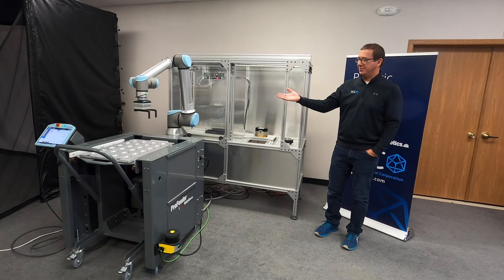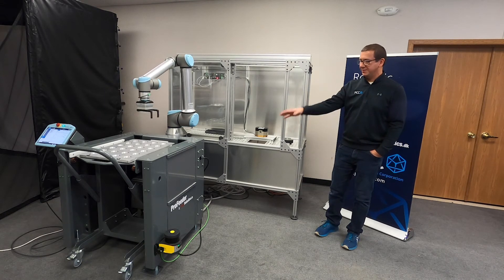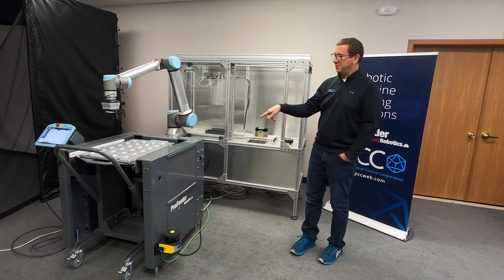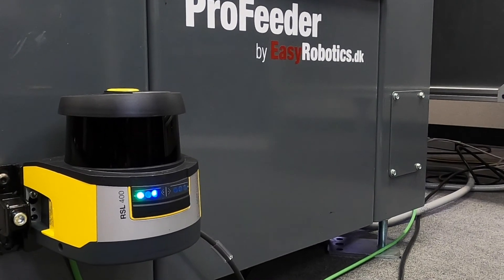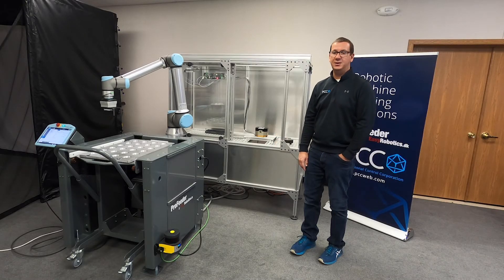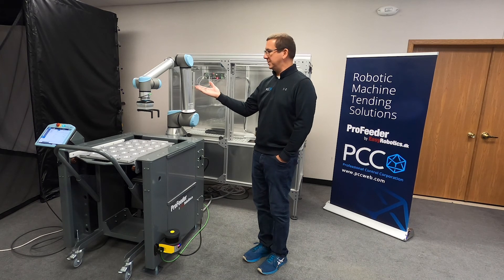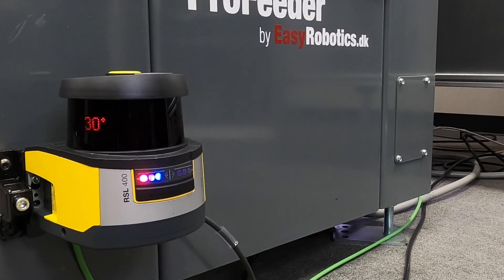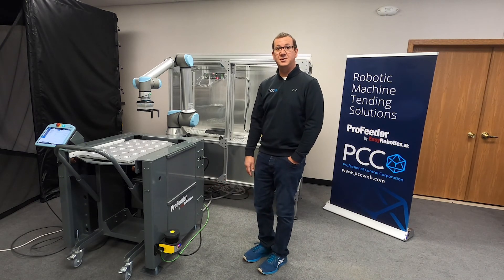As you can see here, we have our collaborative robot running at normal speed, going to three different waypoints, and the scanner is scanning a protective area. Now I'm moving in — I'm in the warning field. That sends a signal to the robot to run slow, as you can see. The scanner output shows A-WF for warning field and the blue LED is on. If I get closer, it gives a safety stop to the collaborative robot. I get red and yellow blinking LEDs, signifying that I'm in the protective field, and the scanner reads A-PF.